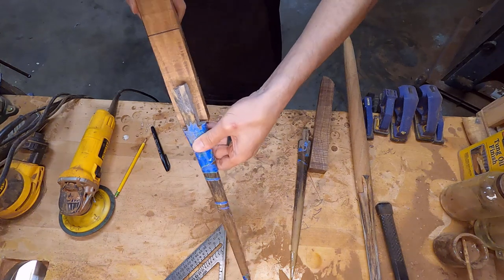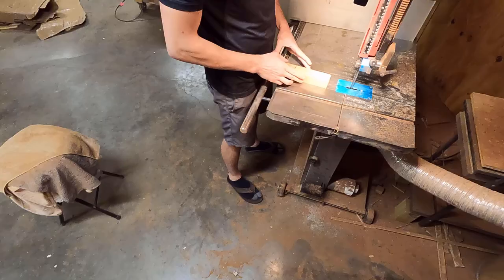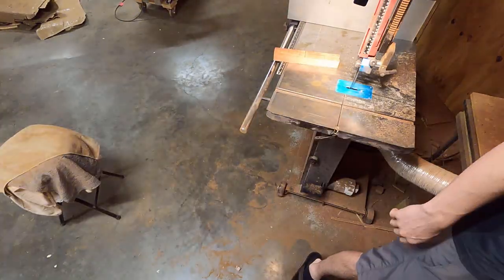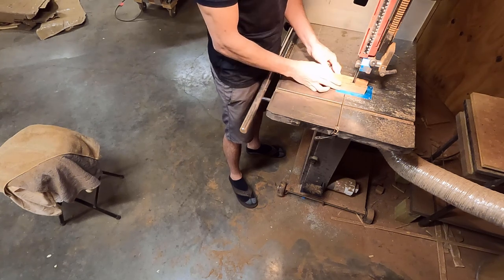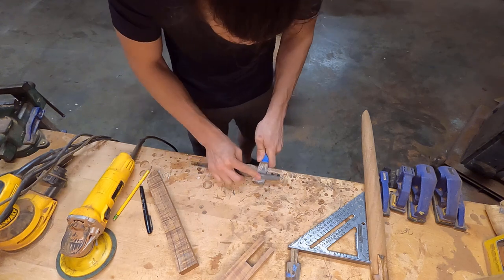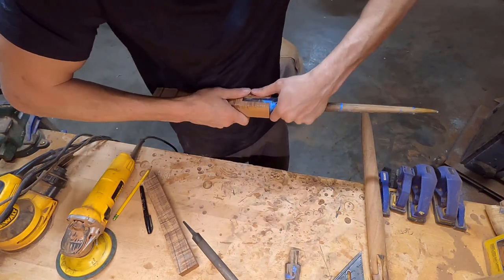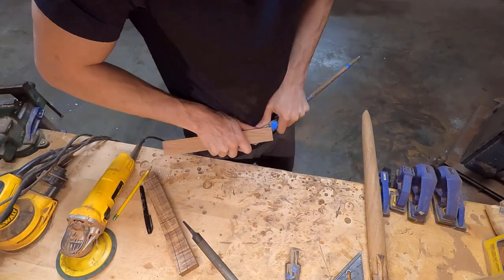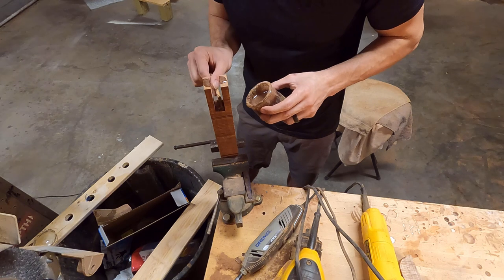The first step is putting in the tongue-and-groove joint. On this first piece you'll notice it has a super long, elongated joint. I wanted to try doing a non-lashed, exposed joint, so I made the tongue-and-groove joint long enough to thread three pegs or cross pins into the piece. A combination of a really tight-fitting connection plus the cross pegs should hold it in really tight. If it doesn't look good I'll just lash the whole thing.